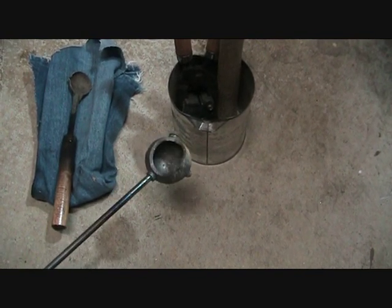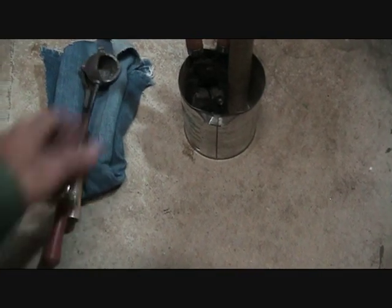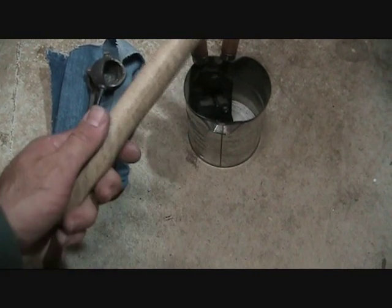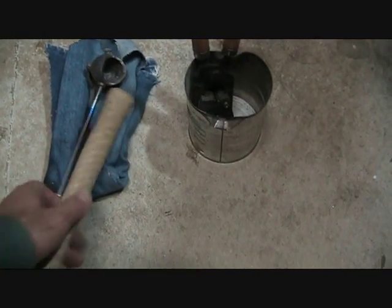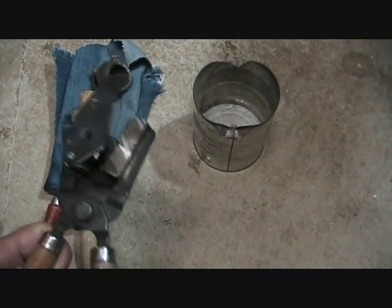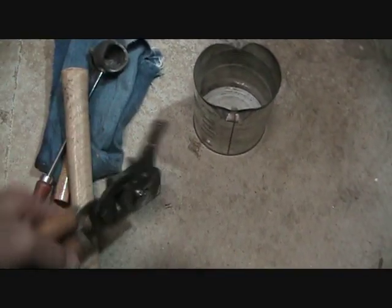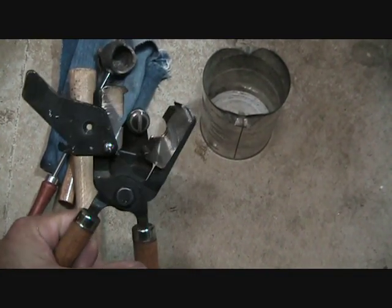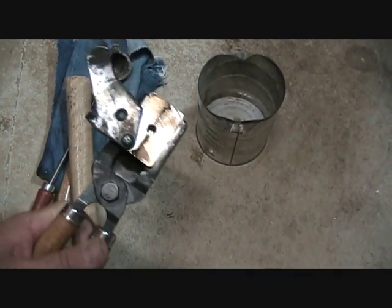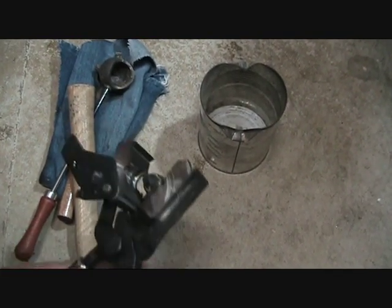Keep it in the lead at all times, keep the temperature up to it. That's my knocking stick for smacking the die open, and that's the Lee die — a one ounce slug die. Got a bit of carbon on it, which is good — stops the slug from sticking.